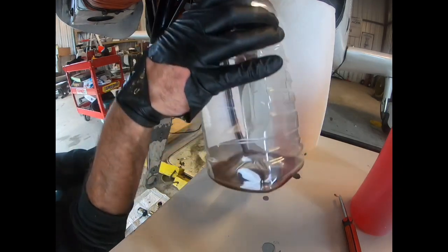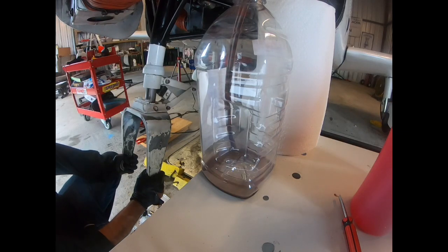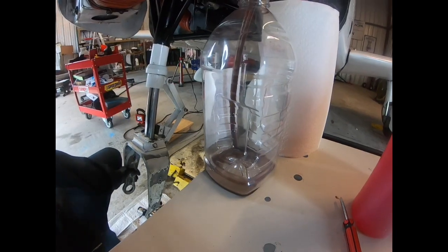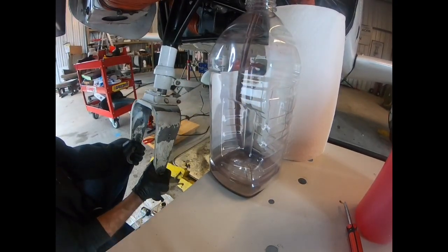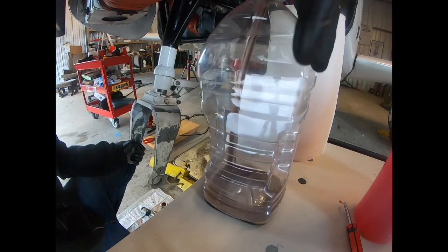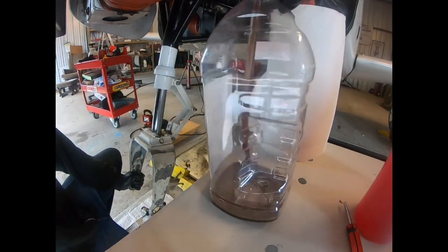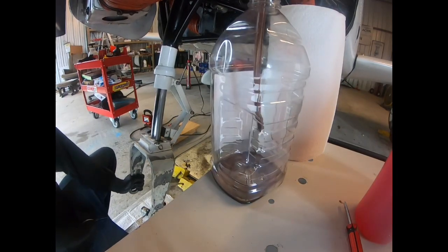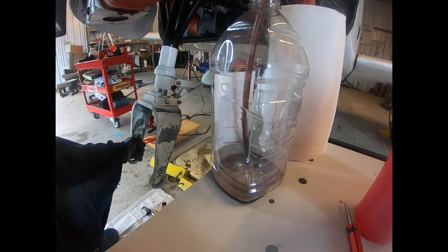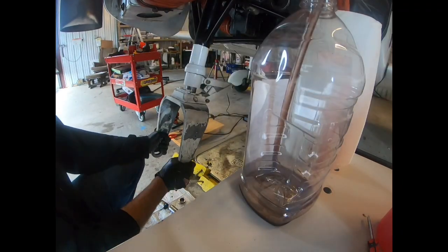Compress it all the way, and really there should be a lot more fluid in there than that. So the fluid's leaked out, could be seals. But we'll exercise this a couple times. The goal is we want to push out all that dirty stuff. We're gonna do an oil change, essentially. Once you've got the fluid exhausted, pretty dirty, not that much in there,